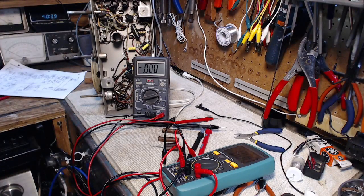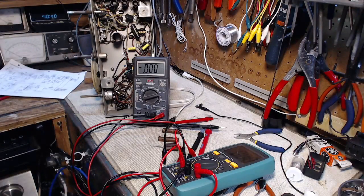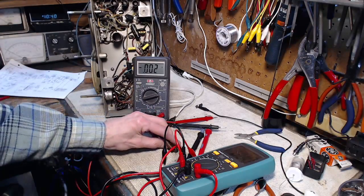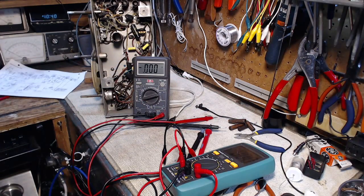So as long as those things are bone dry, nothing will happen. But when you get a little bit of moisture inside them, they turn into batteries because of the two different metals that are in there. And I've been encountering this all the way along. If you've watched enough of my videos, you've seen me do similar tests and discover this voltage throws off readings, ohmmeter readings and stuff like that, because an ohmmeter is not going to work where there's actually a voltage coming out of the capacitor.